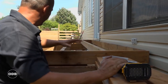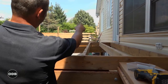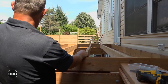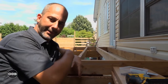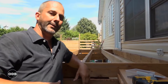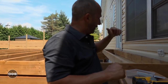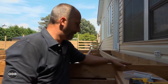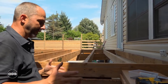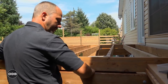Now that we've got our basic structure in place — this side all screwed down and corners pinned — we're not too concerned about what's going on over there because that's all going to get custom cut. We're going to change the angle, so we're just leaving it in place, resting on the beams for now. We'll have a talk with the client and map out the final design. What we have to do is get this all squared off before we can measure off the rest of the deck, because the whole deck is built off the idea that we're coming square off the wall right down the middle on this box beam.